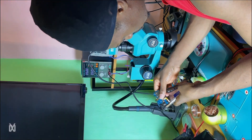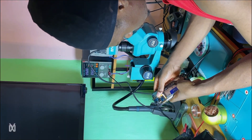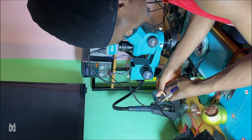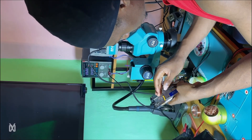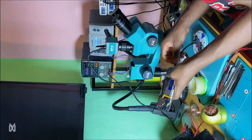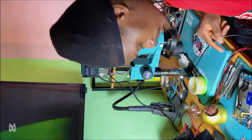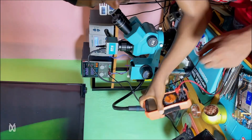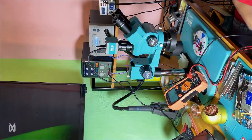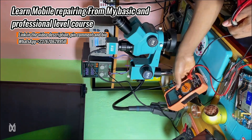Because of the high current trigger, I tried to feel if there was any heat in the PCB, since a high current draw will normally cause even a small amount of heat. I was feeling for heat because I don't have a thermal camera, and there was a little bit of heat coming from the PCB, which confirmed there was a short.